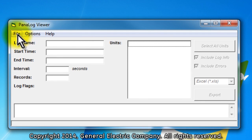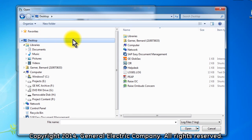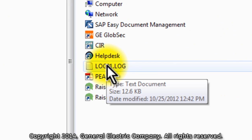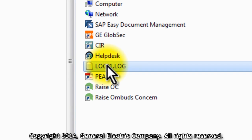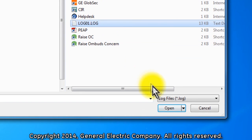Click on the File selection at the top of the window. That will open a drop-down menu, then click on the Open option. This brings up a navigation window. When the PT-878 saves a log to your computer, it saves it on the desktop, so make sure you have the desktop location highlighted. Look on the right-hand side of the window and you should see the log file you saved in the list of items. For this example, we transferred a file called log01.log. Select the log file by clicking on it and then click on the Open button at the bottom right of the window.